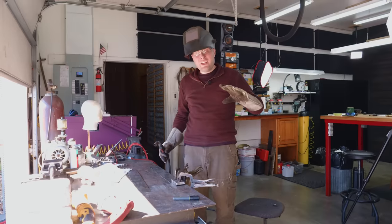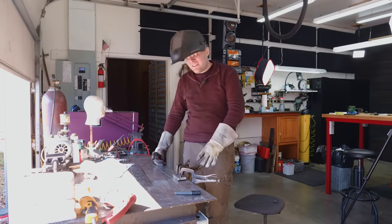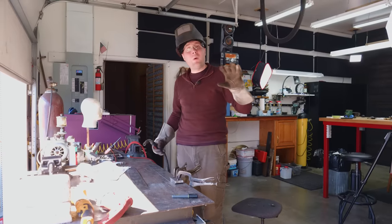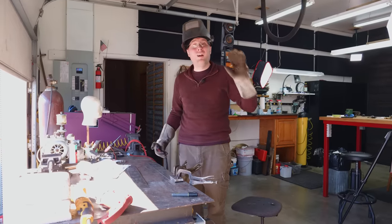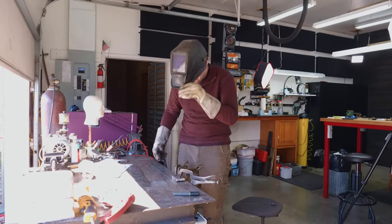Got all the tiles ready to go. Got our sheet metal ready to go. I'm gonna clamp a couple pieces down to the sheet metal at a time, tack weld them in place. Once I get all the tiles tacked down to the sheet metal, I'll weld the other piece on and then seal all the seams up so we'll be able to do nice, clean, zero atmosphere forge welding on this.